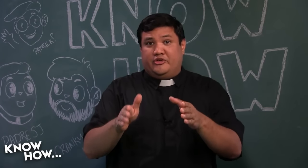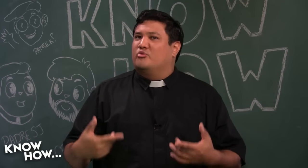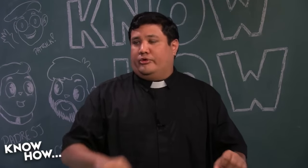This is something that you need to do. We've included this little piece of code. So if you buy yourself some potentiometers, just run the calibration really, really quickly. It just takes a couple of minutes. Write down what the lowest value and the highest value is recorded for your particular potentiometer. But you should probably code for beyond that, just in case.